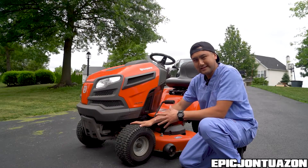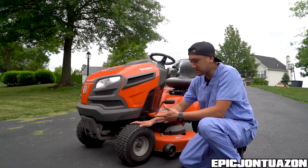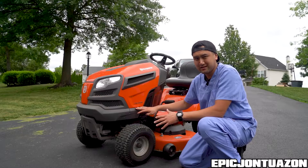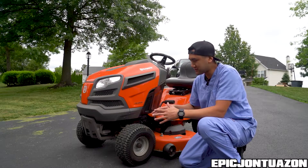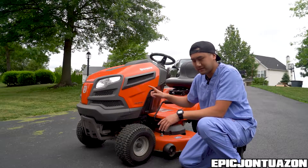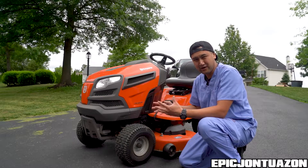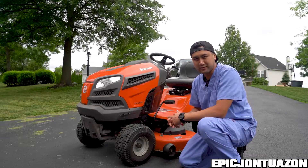The first thing I'm probably going to do is something maintenance-wise. It's got 50 hours on it — it's a used tractor, but still fairly new. I don't think it's even had an oil change yet. 50 hours is about the limit for the first oil change, and this is two years old. I've seen some videos where it gets very messy when you're changing the oil, so we're definitely going to come at you with some ideas on that.